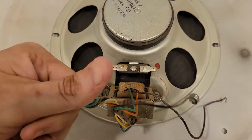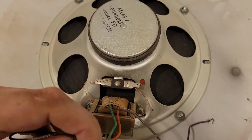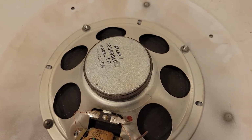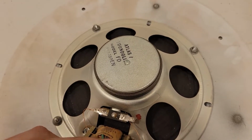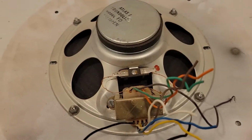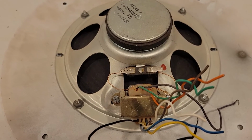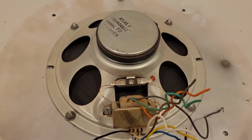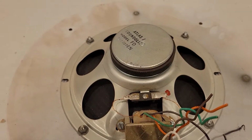So first of all, we're going to need to do a 70 volt wire one way or the other. So basically the amp that's going to be feeding these speakers down here is up in the projection booth. If you ever see me, or I think early in this video even, you'll see footage of the amps up there, quickly. A big rack of silver-faced amplifiers. And the one that's going to be running the area back here will be at least 30 watt, potentially 60, depending on which amplifier I want to use. Probably a 30. So that means I've got a 30 watt budget for these speakers back here.